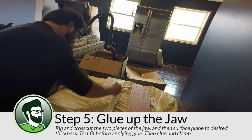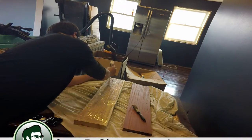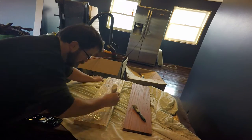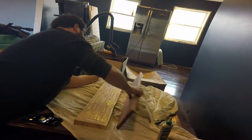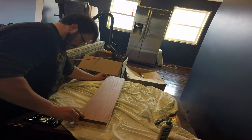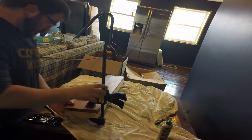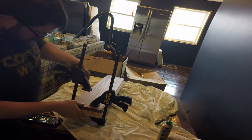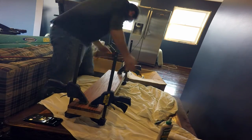After coming up with a sketch of the new jaw, I ripped and cross cut the scrap Douglas fir and scrap bubinga — if at $8 a board foot there can possibly be such a thing. I surface planed both pieces off camera to get a nice tight glue joint, and then I brought them both in the house because it's still too cold out for the glue to set properly. After that, I spread out a good helping of Titebond 3 across the surfaces and then applied pressure with a couple of quick clamps.